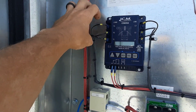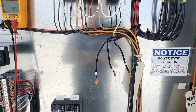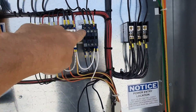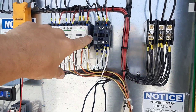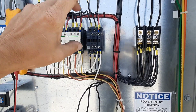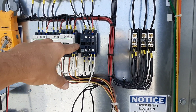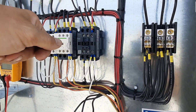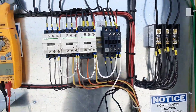P5, P6, and P7 is the load to the phase monitor, and it comes out of the compressor contactor. I've got my compressor isolated right now. I'm going to turn this on because I'm pretty sure I know what the problem is. Checking across my legs — one of my legs was closed, so I was single phasing whenever we kicked power in. That's probably why it happened immediately when they would turn power on. One leg was closed; I got to messing with it, the leg opened. Now I'm reading 10 ohms across this leg of the compressor contactor; the other two seemed okay.